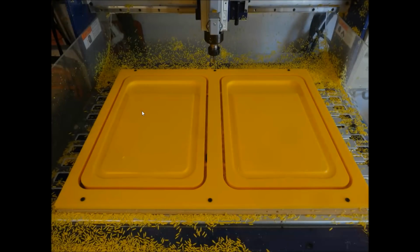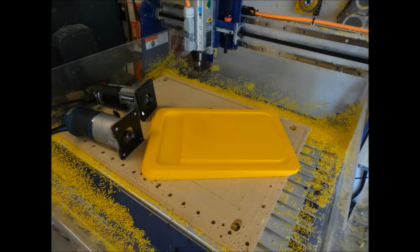And then there is a bit change here to a 1/4 inch end mill. We use an up spiral for this plastic, and you can see that it's cut out. And seeing that I just cut 2 of these, there was no sense of using the round over bit that was earlier pictured. I'd still have to do a flip operation. So I just simply went over to, I keep on my shelf 2 different routers, one with the 1/8 inch and one with the 3/16 round over bit, and went ahead and rounded over the edges and completed those 2 boards.